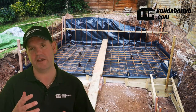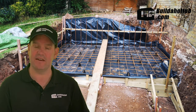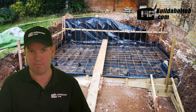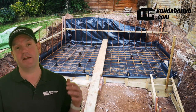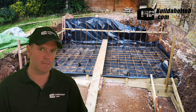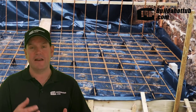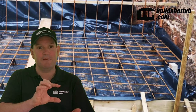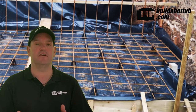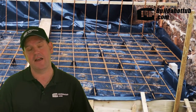On top of the liner, we're going to add a steel rebar structure, which gives the concrete extra strength and prevents it from cracking. The rebar can be bought in strips or pre-made sheets. As you can see behind me — this is Neil's build from the case study on the website — he's used the pre-made sheets, which are much easier to put in place. He's also lifted them up off the ground, using plastic lifting pieces or a couple of rocks, so the concrete can go over the top and underneath, keeping the rebar in the middle of the slab where it gives the best rigidity.